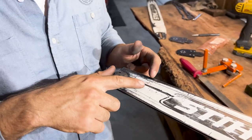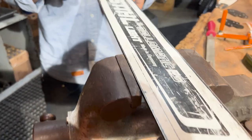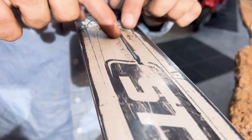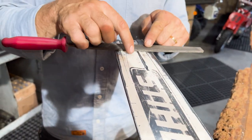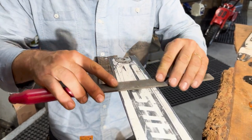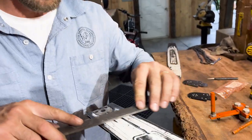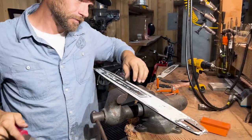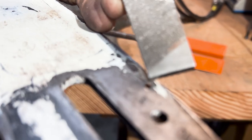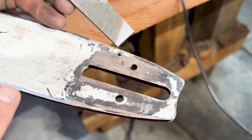This Stihl Lightweight bar has been crushed in a cut. These Stihl Lightweight bars have ridges running down their insert area, and if you put a lot of weight on them it'll smash the material between the ridges and cause it to be wavy. They're hollow inside — those ridges are the structural pieces. I'll continue to run this bar as long as I can get a flat plane. The tuning has already removed material from the ridge that was pushed up and raised slightly.